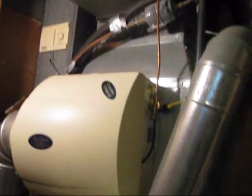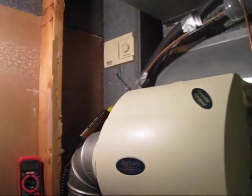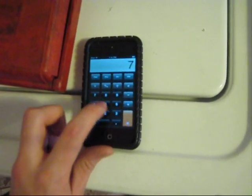Alright, furnace is shut off now. Cooled down to about 90 and 71, still dropping on the return. So we're looking for a 40 to 70 degree temperature difference, and the highest I saw was about 125, and I saw 72 when I turned it off — so it's a 53-degree difference. That's pretty good considering they wanted it between 40 and 70. It's almost just in the middle.